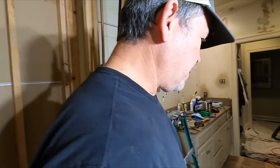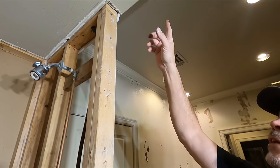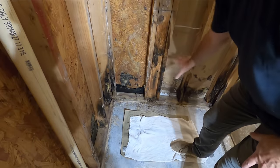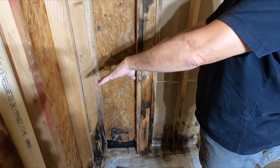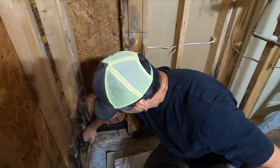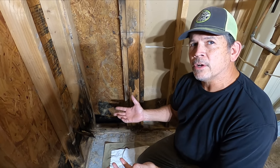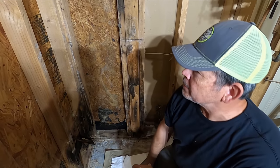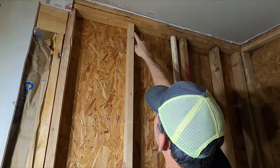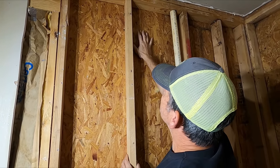Now as far as framing, I got up in the attic and the ceiling joists run this way. We have this soffit here. I thought about it a lot and I'm not worried about cutting this out and having the roof come down on me. This stud is already rotten, so it's not doing its job anyway — the load has already transferred somewhere, probably to this sheathing. For example, if I were to cut this stud out, the load from the top plate is going to go to these two studs, and the sheathing is going to help also.